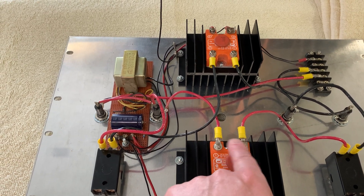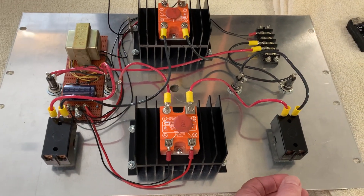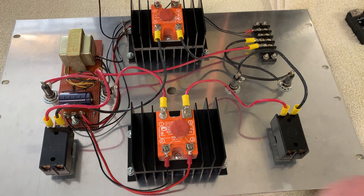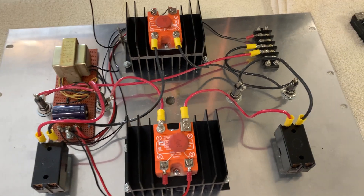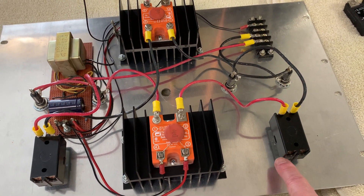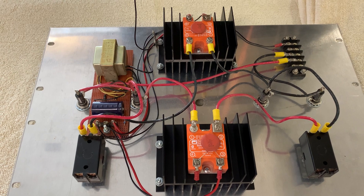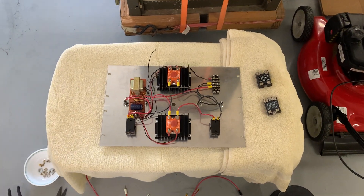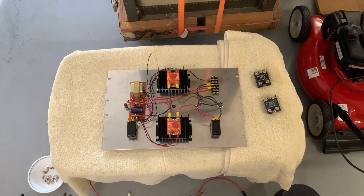I'm going to leave the wires red but make this one the neutral and this one the hot black. I'll make this switch so that if I go to run the sideband adapter, the plate transformer for the 810s won't come up — I want the modulator off. I'm going to make one wire white and one black so one handles one transformer and the other handles the other. I'll work on the next video with everything lit up again. This is W5HRO.